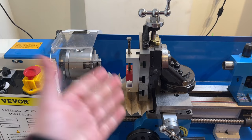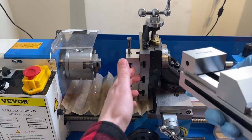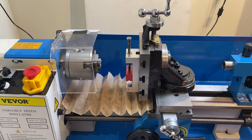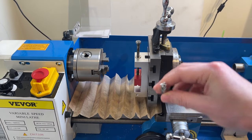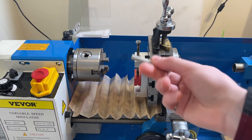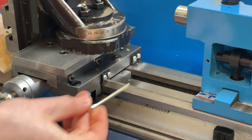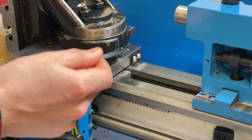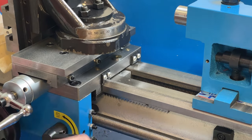I figured we needed a part to make for our first actual cutting test, so I'm going to make some vice clamps to hold the milling attachment onto the front mounting plate — out of this aluminum I have lying around. I'm using an 8mm four-flute end mill. I know before you mention it in the comments this should be a collet chuck — I know — but the problem is I don't have one, so here we are. One thing absolutely critical to mention: you need a carriage lock on your lathe. There are plenty of videos online about how to make one. Without it, the carriage is going to slide all over the place and completely ruin what you're trying to do.